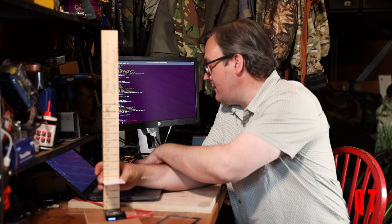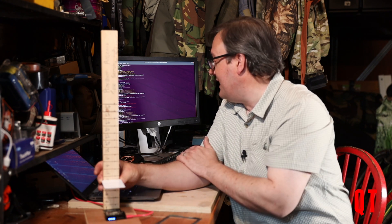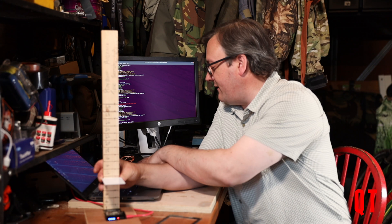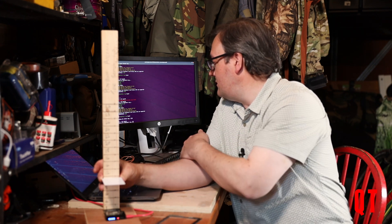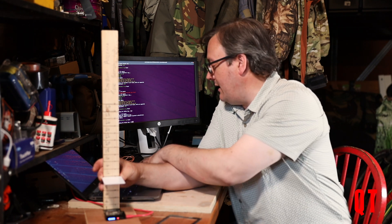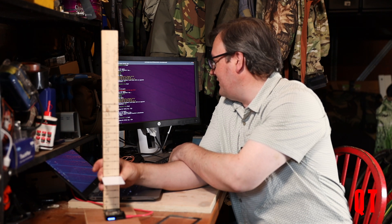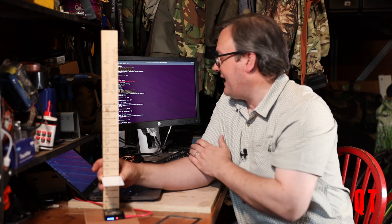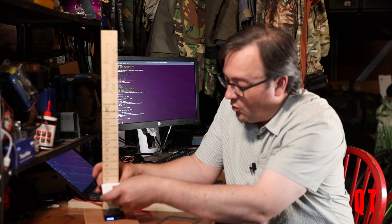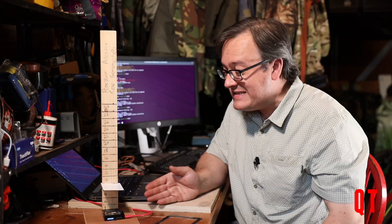Let's hold it at about half that distance — actually this is nine centimetres. Let's see if it can do it. Yes, nine centimetres it can. If I go a little bit further up — it still can. Let's put it up a little bit higher. No, no, no. At just under 10 centimetres it can just about detect it, but it can't identify the card type. So therefore, we know the reliable reading distance of the standard antenna is about eight centimetres from the bottom, give or take a little bit. Now let's swap on the long-range antenna and see how much further we get.